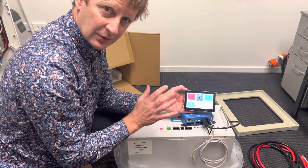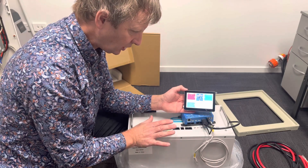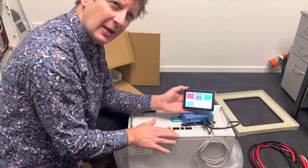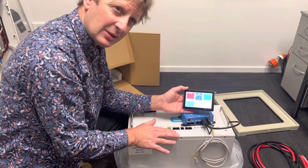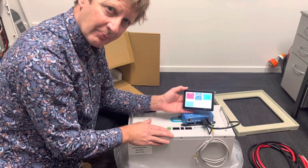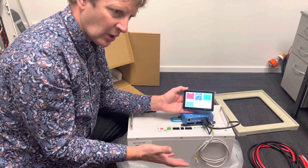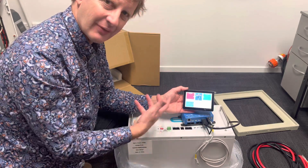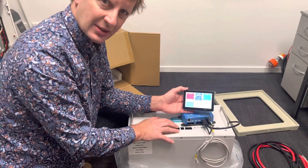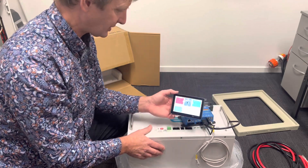By the way, the battery will actually run standalone. You have voltage tolerances of 47 volts absolute minimum, and 55.5 volts is the recommended charge voltage — it will allow 56 volts, but that's the absolute maximum before the BMS turns itself off. So you can run this with an inverter that doesn't have CAN bus comms or any comms at all — you can run it standalone, which is really handy.